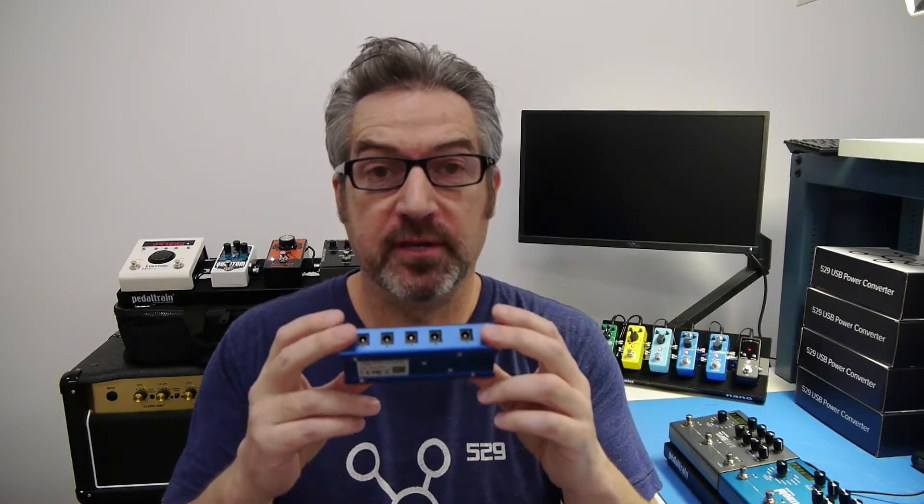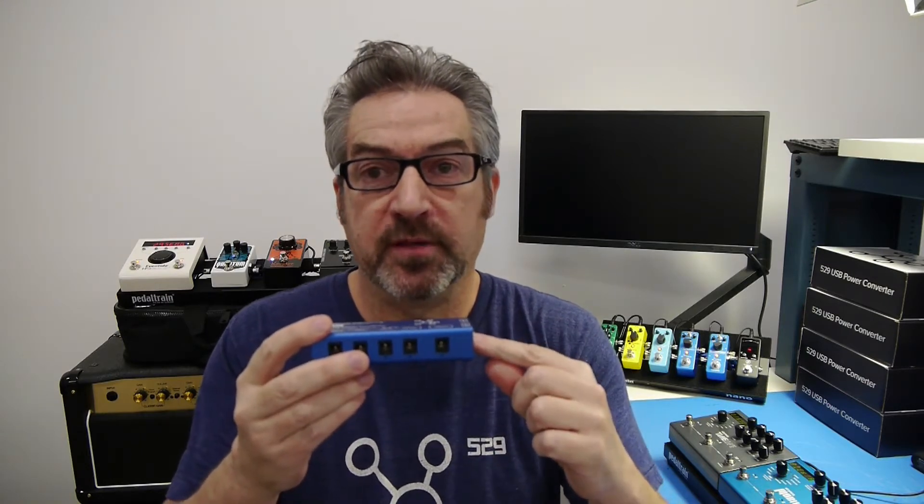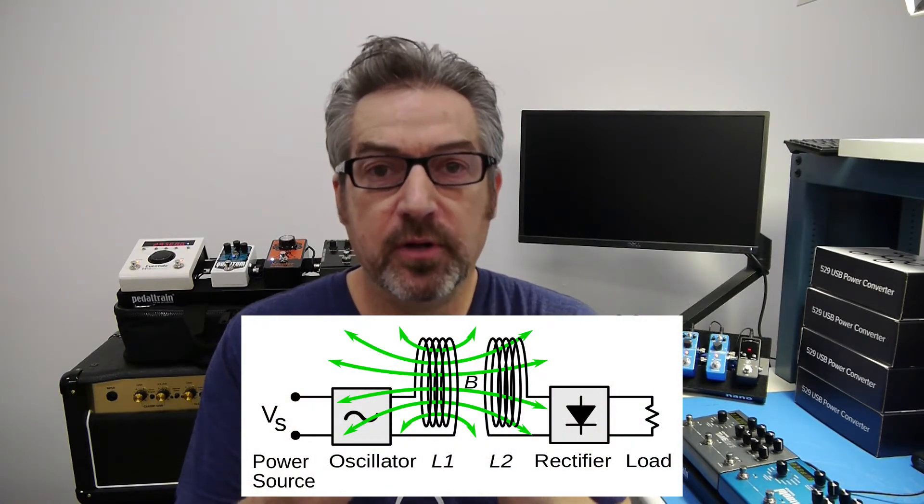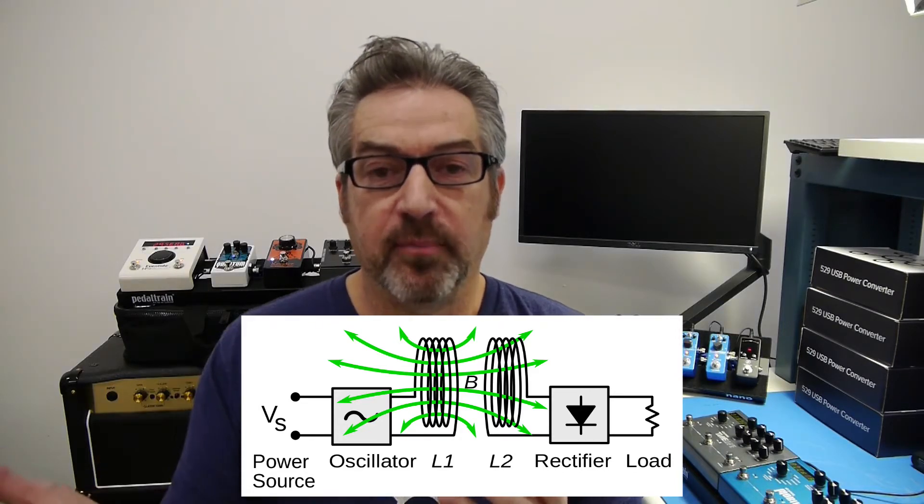This is why isolated outputs are very popular with pedalboard power supplies — and all of these are isolated. Since my pedals are running DC, and since I'm using my 529 just to convert between different voltages — getting 5 volts in from my USB supply and 9 volts out — it's all DC. There's no AC at any point. So I don't have any AC to DC transformers, I don't have any rectifiers, none of those components that can cause electromagnetic interference — noise induced by proximity. Plenty of us are familiar with putting a sensitive device like a fuzz pedal on top of a power supply and the transformer inducing a lot of noise in that device.